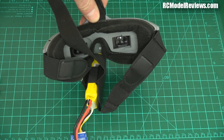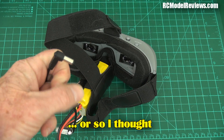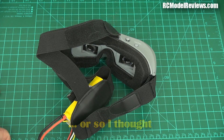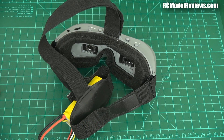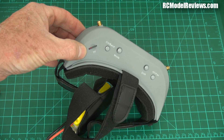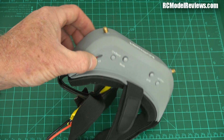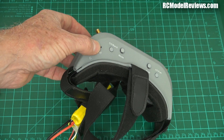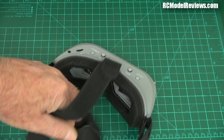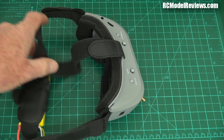There is nothing in the goggles and no amount of fiddling with the cable seems to do anything. So it's not a fractured cable, it's not a faulty wire from the balance port as far as I can tell. It just seems to be completely random. And if you are recording onto the microSD card when it goes beep and basically goes black, it won't record again onto the card unless you take the card out and put it back in. There's something funny going on inside these goggles. There's only one thing worse than no FPV goggles and that's a set of FPV goggles you cannot trust.